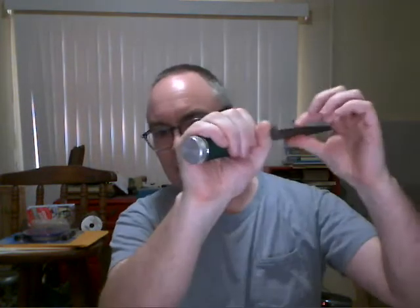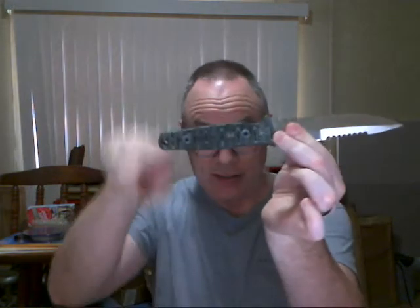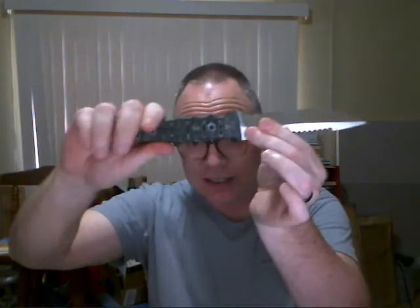The other idea is shape. We don't want a round handle. This one's perfectly round, and the disadvantage — besides our hand not being perfectly round — is that you can't identify what position the blade is in. On a single-edged blade, I want to know where the blade is when I pick the knife up, and I can't tell on this one until I either look at it or I get right up on the guard and then adjust. Whereas something with more of an oblong shape, especially on a single-edged blade where front to back are different, as soon as I pick it up I can tell exactly where the blade is oriented and exactly where I am on the handle.